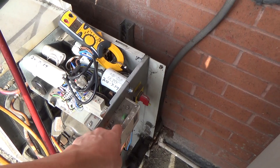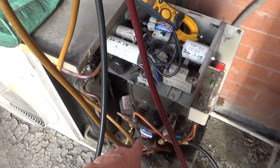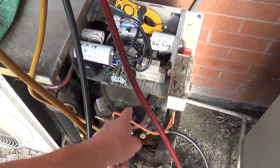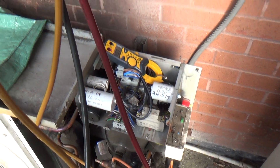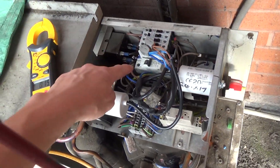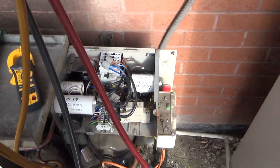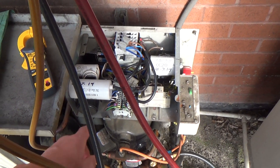What it's doing is chattering and not going off cleanly. It's a single-phase compressor without as much starter torque as a three-phase one. It goes off on an HP, resets, and it can't start against that load. And then it's been tripping the 20-amp breaker in there. I came out the other day and it had tripped — we'd had a load of lightning and storms overnight, so we thought that's what had caused it.